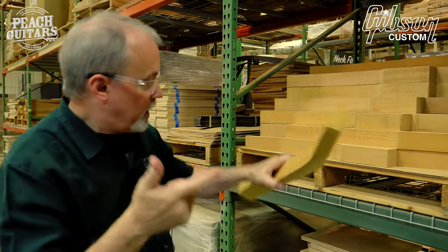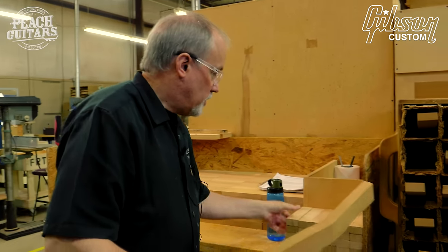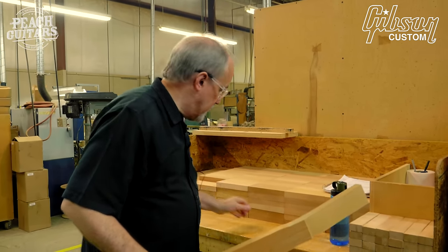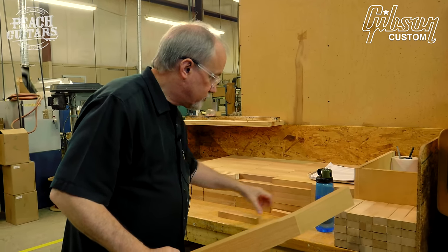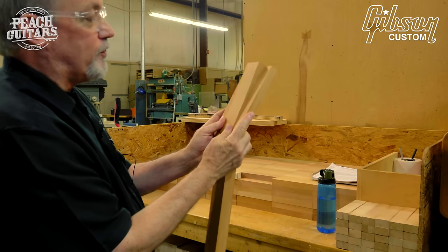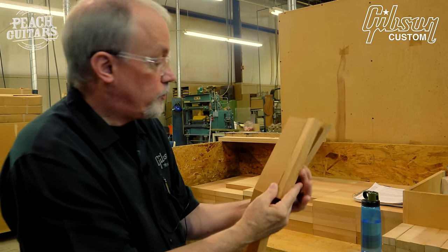So we have this neck. Now we turn over here. So here's the raw neck. And depending on the mahogany shade and color, these are a lot of wing blocks, in matched pairs. It's like children's building blocks. Assuming these are the proper wing blocks for this neck based on color, and that looks pretty good, simply we'll glue it with white glue.